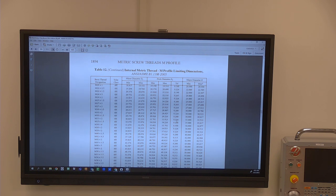Without GD&T, if it's out of tolerance, I scrap this part. With GD&T, I can either move back to the correct position and enlarge the hole, or I could really just enlarge the hole so that the thing that has four pins that stick out of it then fits into it. Normally you would say, okay, we're either going to scrap this part, or we're going to bore this out bigger, put a bushing in it, and then rebore the hole. GD&T says, we don't actually care about that. Can you make that hole fit the pins by enlarging it, or enlarging and changing the position of it? Yeah, I can do that. It's actually way better for you to live in the GD&T world.